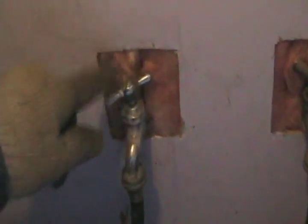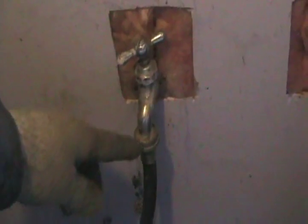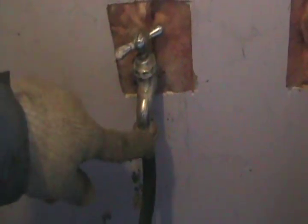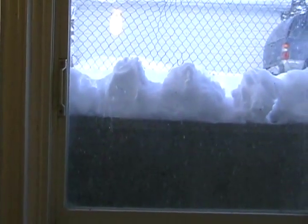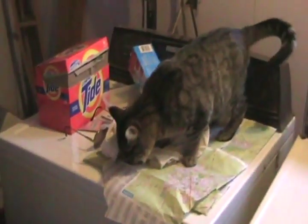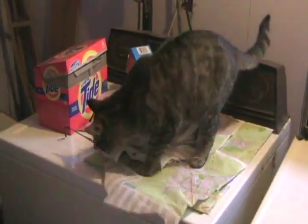If you don't have compressed air, I recommend going to your washing machine hookup and unhooking the hot hose. Don't bother using your pipe on the side of your house because that's cold water. Get your garden hose and screw it onto there. Run it out the closest window. Run the garden hose until the water coming out is hot. Put the vise grip on the garden hose just like I showed you with the air hose, and then release it when the water is nice and hot and blast it that way.